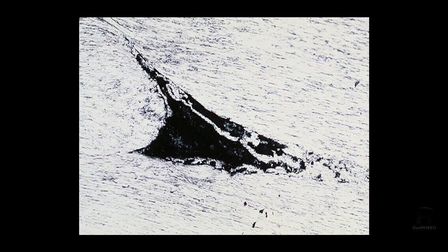This is the cross section of a wire that is just beginning to form the problem of central bursting. Right at the beginning it was a crack, and now it's starting to get bigger. You can see a crack starting to form on a 45-degree angle, and you can see that a cone end is starting to form.